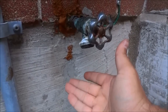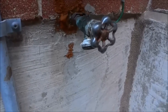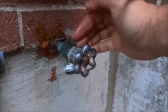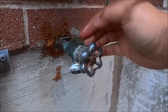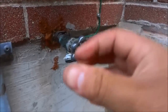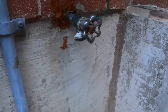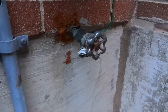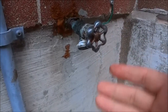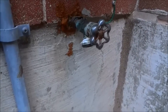I've fixed the leaky hose faucet problem. The solution was really simple: I took off the front end portion of the hose faucet, replaced that washer, and it was a very inexpensive solution that didn't even take that long. It's something you can do when you have a leaking exterior hose faucet. And that's all I have for you today.